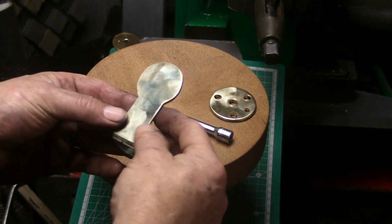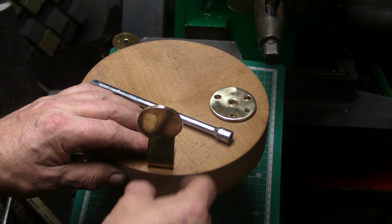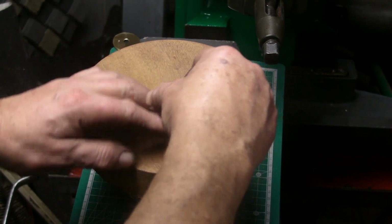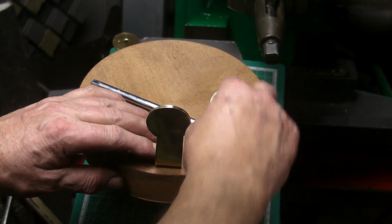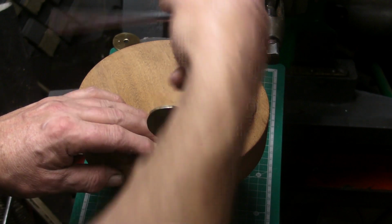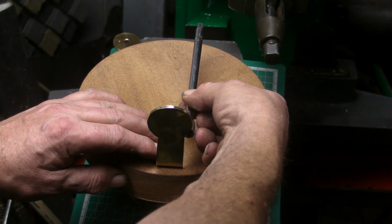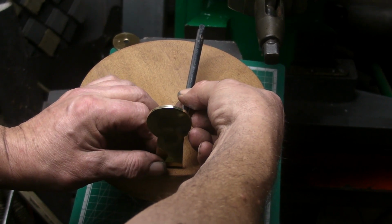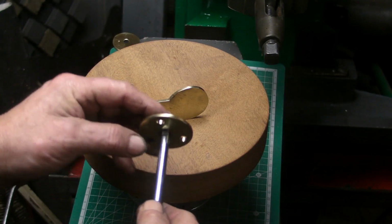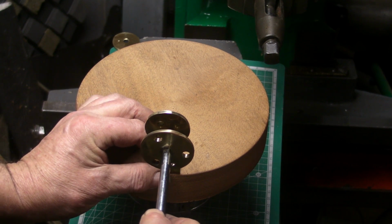Well, these crankshaft supports will fit on that way. There's two, one on either side, screw through with these holes that I've made, and then the crankshaft, there's got to be a hole drilled in the centre of these two. The crankshaft then will fit through both of those, and then this handwheel that I made will go onto the end of it. I think you get the idea there, guys.